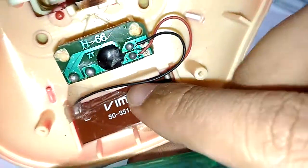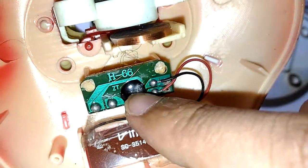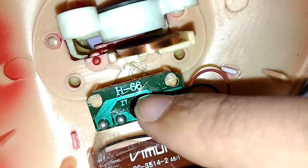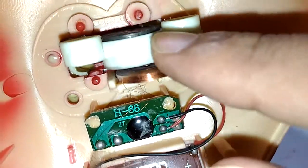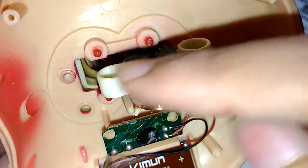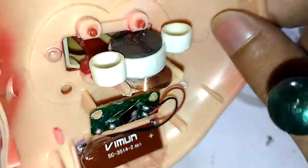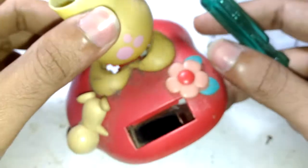So it is really dead simple - just a solar panel connected to a pulsating chip. It can't be a microcontroller, so it's going to be an analog chip that creates pulses, and those pulses drive this coil, which creates a magnetic field that interacts with the magnets and repulses it. That's basically what's inside - really simple.